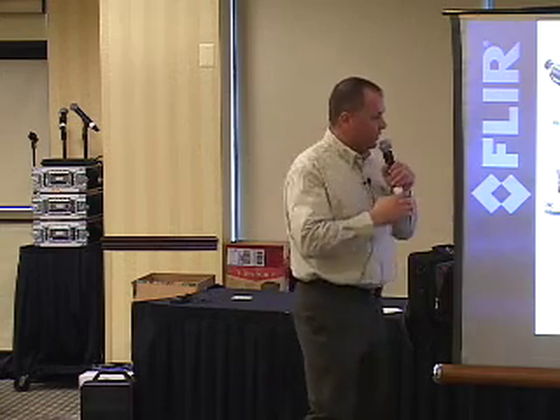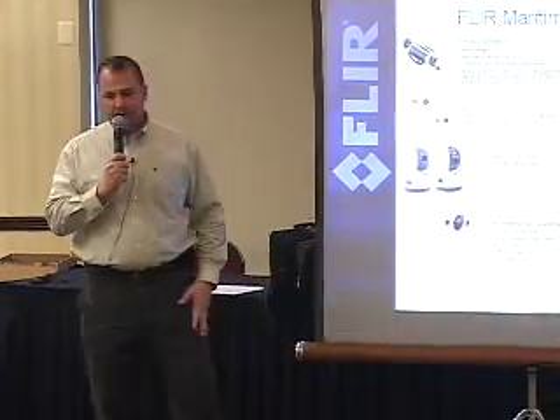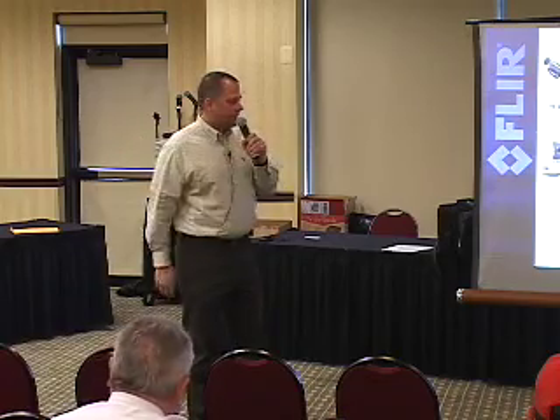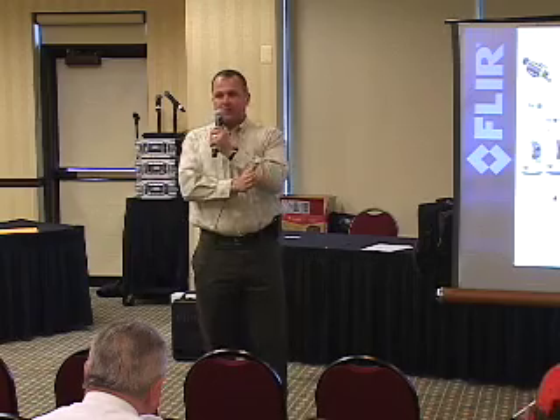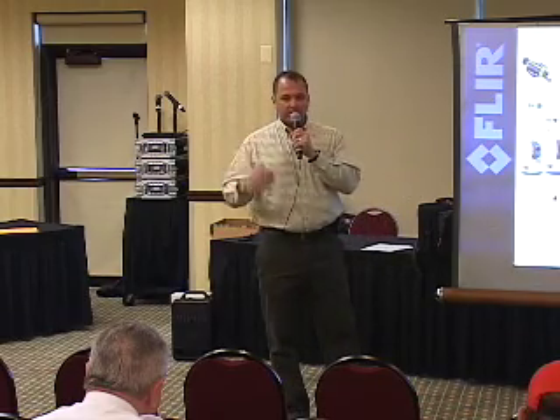The M-Series — I have a demo here — comes in three different flavors, introduced last year at the Miami Boat Show and very well received. It has additional features the Navigator doesn't: proportional control on the joystick, scanning features when you're offshore, and backing-down features for larger vessels. It can be mounted so the camera looks back at the stern as you're backing into a slip. It has a rear view mirror feature that flip-flops the image so left is left and right is right, making it easier to back into a slip.